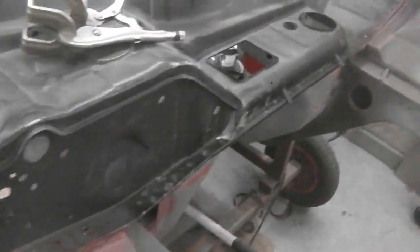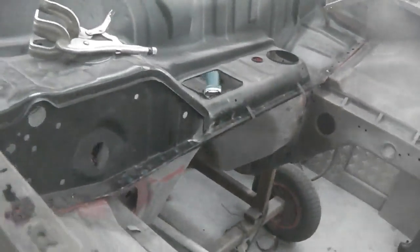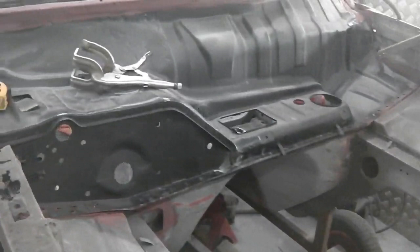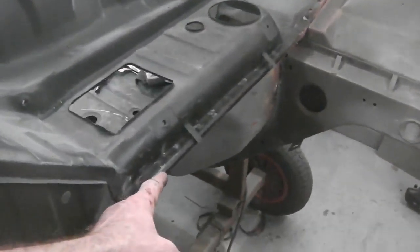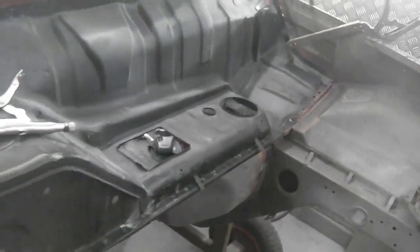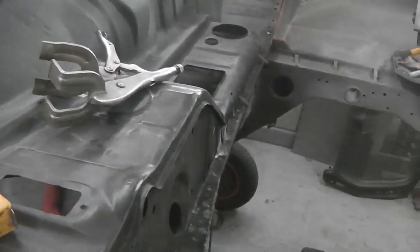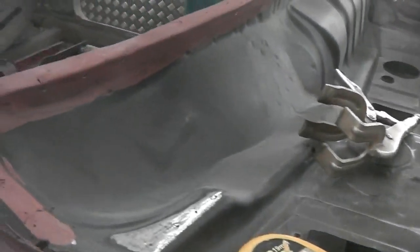Crackling. Right, we could probably get a couple more spots in, but for now we're done, and you'll see that finish. That's very, very nice. I'm pleased that the spot welder got in there, because I wasn't sure. And just the lip here protrudes out a little bit, and you're only about halfway, which is how they are actually. You've got to get right tight in with a spot welder on that run. So that's that. Now for the dashboard.